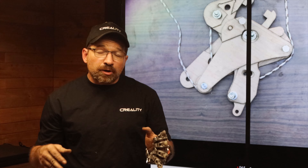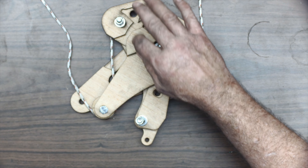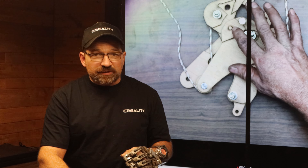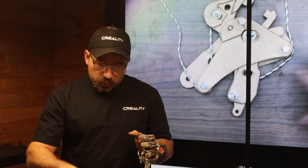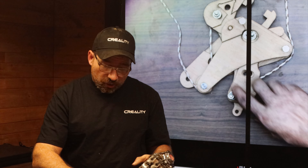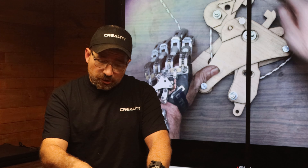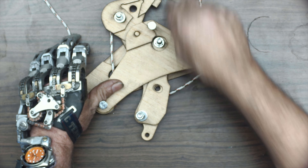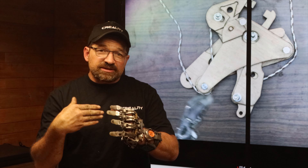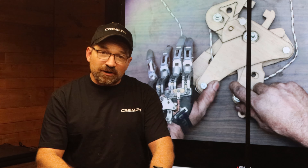That functions all well and good, but what about the lock under load? There's a piece of triangle tooling that goes in these two areas right here — a triangle here and a triangle on the underside of this top plate. What they do is once the fingers are closed, if you continue to pull just a little bit more, there's a hinge right here and once enough force is applied to overcome the spring, these two plates close. That creates an interference in those two pieces of triangle tooling, which keeps the fingers from back driving.